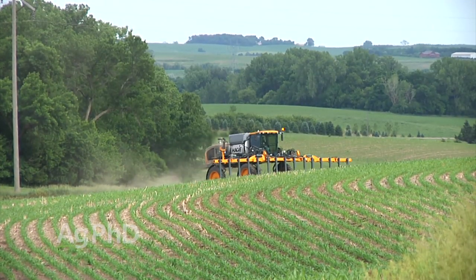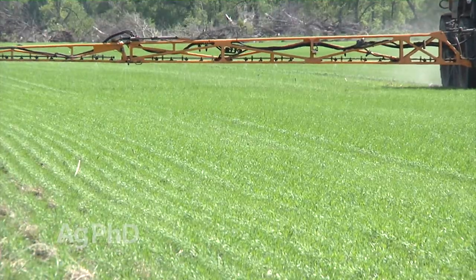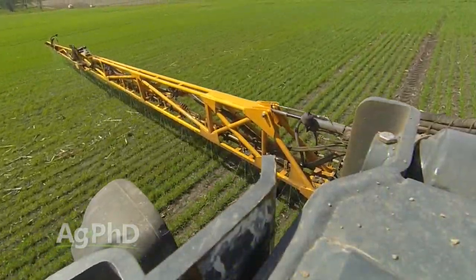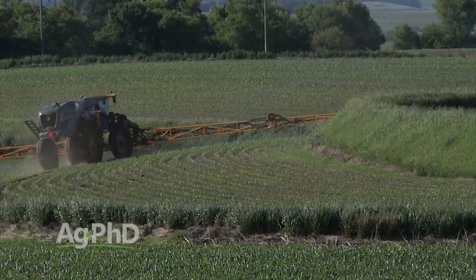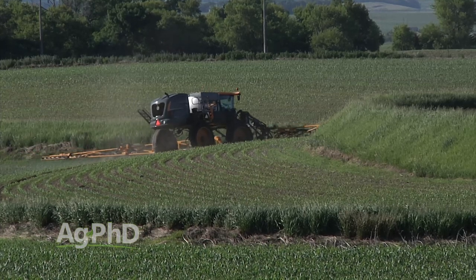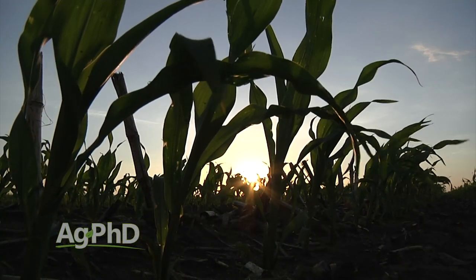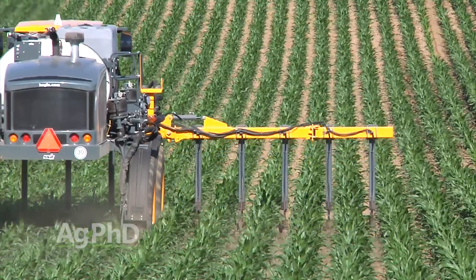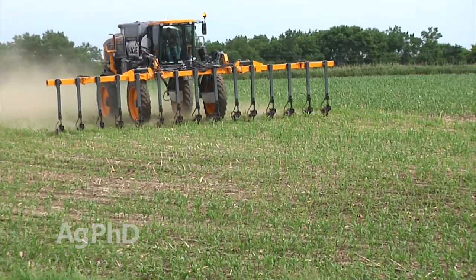Where it's easy to run into problems — especially with coulters and wide drops — is on rolling terrain with terraces and point rows. It's tough to stay perfectly between the rows. This year we were doing some nitrogen applications in our wheat with a nozzle that does the same thing as a stream bar in wheat. Hypro has a nice 6-stream nozzle; others have a 3-stream nozzle. Either way, the purpose is to avoid broadcast application that can burn leaves. We tried this system in corn, putting stream nozzles down between the rows. The challenge is uneven terrain and especially windy rows and terraces. With all the turning, it's easy to end up right over the crop, and if too much nitrogen gets in the whorl, it's not very good. However, it appears we did a pretty good job with it overall.